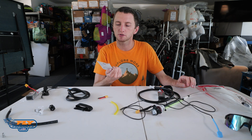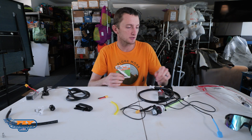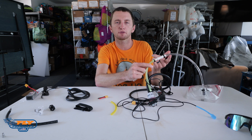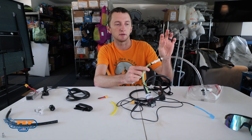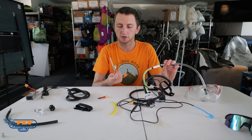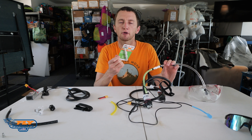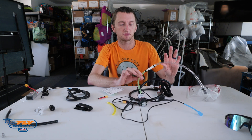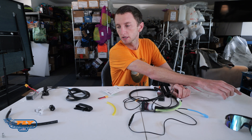We're also using a vacuum line connector. On our system it goes from the bag to the pump because of the size difference between the bag line and the fuel pump. Rather than getting a bunch of goofy connectors, we just bought this for about $4 or $5 at O'Reilly's. You trim it down to fit your tubing size needs, it fits right in, works perfectly, and doesn't leak. That's pretty much all you need.